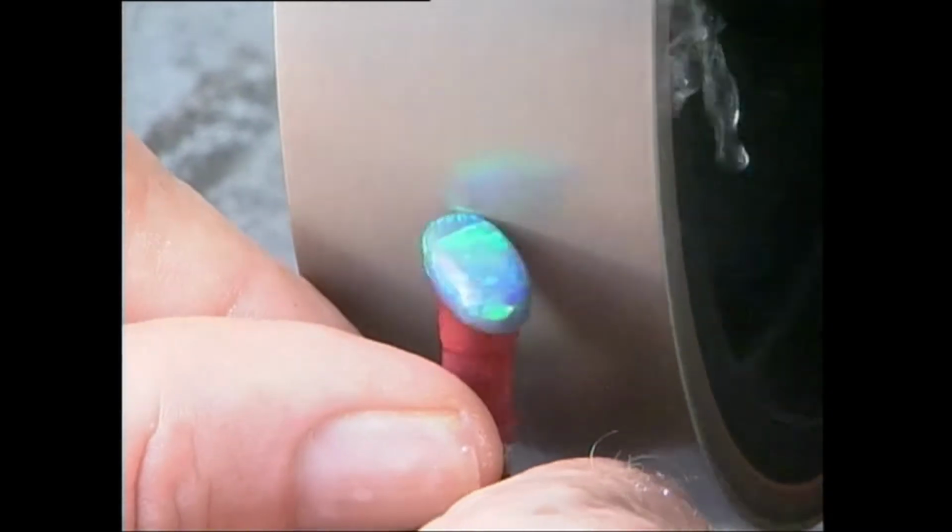The stone is slightly out of shape. A little trim on the ends. As I say, if you do trim the ends like this, you have to go back and bring the whole thing into symmetry. See here, I'm working the longer ends more than I would the shorter, because they cut less when you're spinning. Nice little stone.